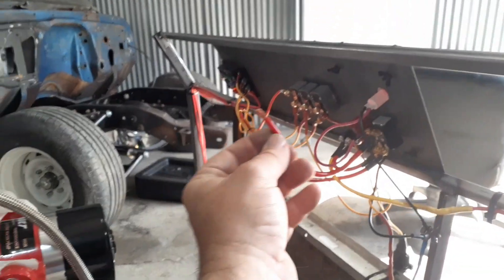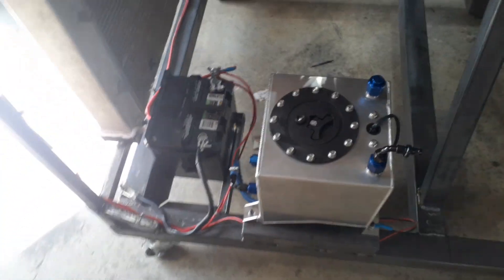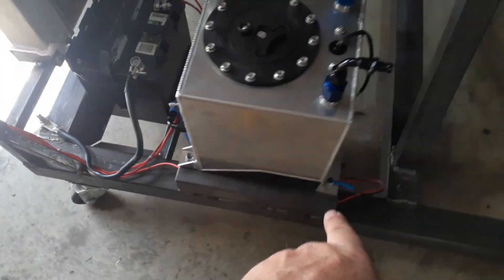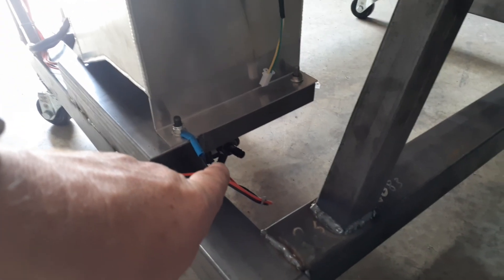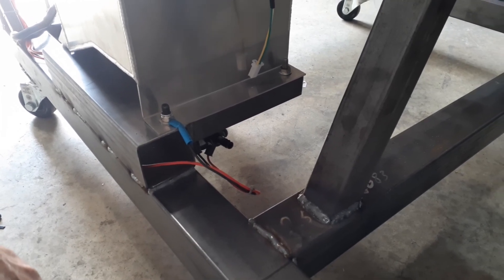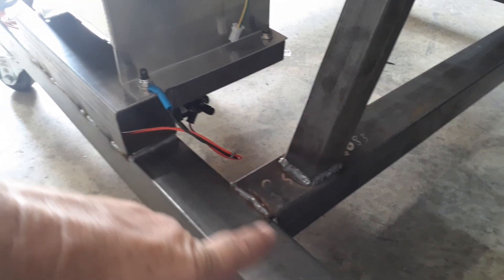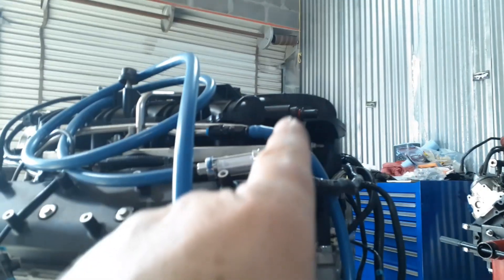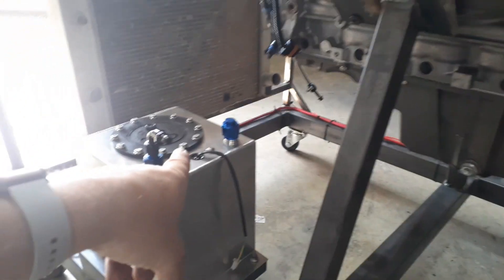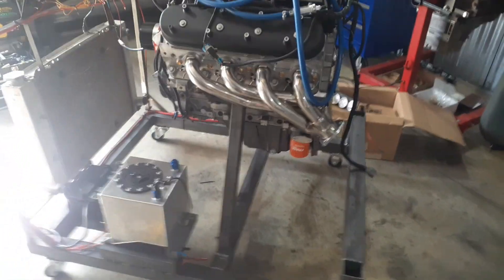The only thing I really need to connect is the ignition - the hot ignition wire - and I've got to figure out how to run it into the ECU and get all this straightened out. Over here we've got our cool little two-gallon, two-and-a-half-gallon fuel cell. We ran it under there - there's a fuel pump under there. It's one of those typical... what's that fuel pump everybody uses? The Walbro 255 - it's like a clone of that. I've got a fuel pressure regulator, going to send it up to the line up here and then return into here.